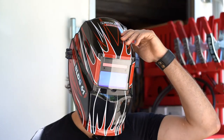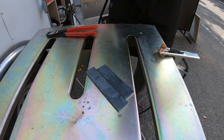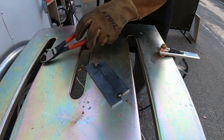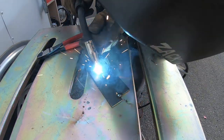My material is grounded, the torch is ready. I'm going to drop the helmet and do a quick test weld. I'll position myself to hold the torch about a quarter of an inch or six millimeters away from where I want to start welding. When I'm ready, I want to loudly say 'Welding!' to alert anyone near me not to look at the torch. After securing the material with two small tack welds, I'll start my final weld by moving the torch forward and in small circles like a loop-de-loop. Then I'll adjust my settings until I see the desired result. This is the art of welding — there's no substitute for experience when it comes to learning how to move, at what speed, and at what distance from your material. Expert welders have literally thousands of hours under the hood. So be patient — we'll work with you over time, so that one day, through observation and practice, you'll just get it.